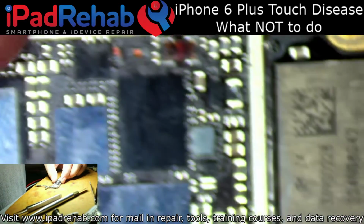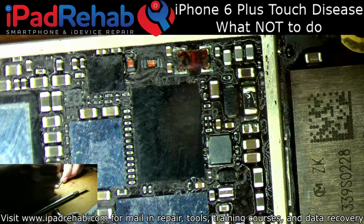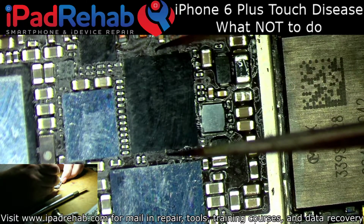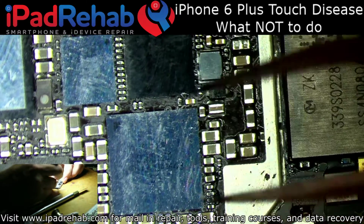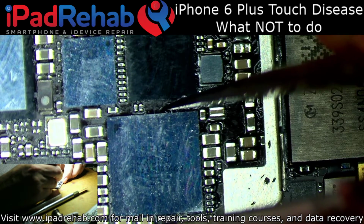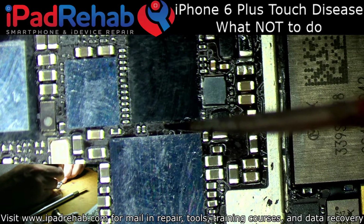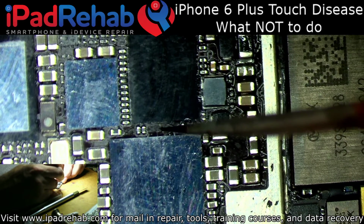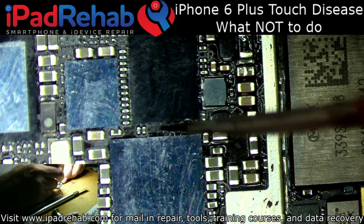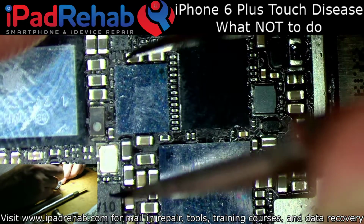And then the next thing that kind of jumps right out at me right away is I like to remove chips with these handy little hook tweezers that I've made. That kind of fit right underneath the chip, but I can't get them under this chip. So whoever reballed this chip did not do it properly. Like, I should be able to fit those tweezer tips under there.